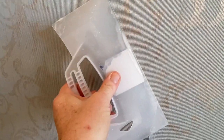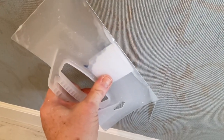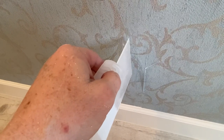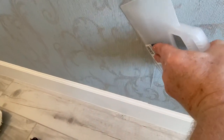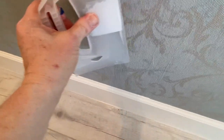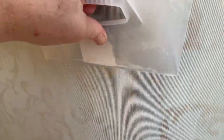You can actually hear it. Listen. Right? Wet paste doesn't make that noise. Air pockets do. Listen. What I'm doing is I'm filling in the point at which attached wallpaper and detached wallpaper meet, evidenced by that noise. But you'll only get it if you move the smoother in the right direction. And now, since it's wet, you want to flatten it out. A lot of science behind it, right?